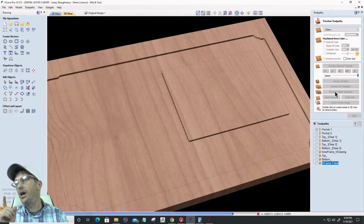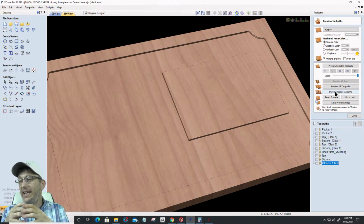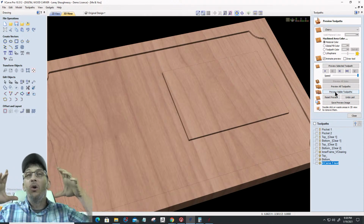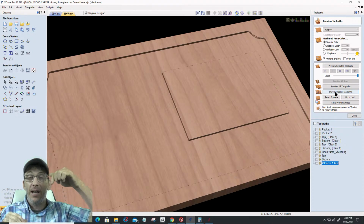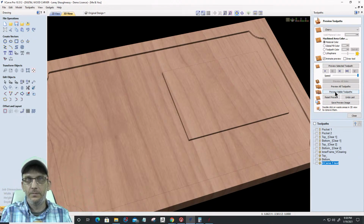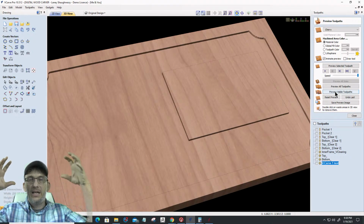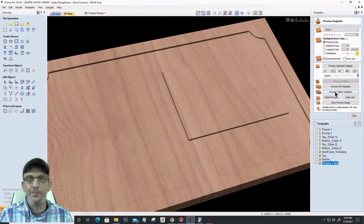Troy Pritchard: offset the top layer? Your top text is offset outward and the border's inward. No, let's not call it layers. Your top text in the welded text layer gets offset outward and the main perimeter gets offset inward. If you had just a text on text sign, your top text would be offset outward and your border inward by that 0.0722, on the welded text layer.